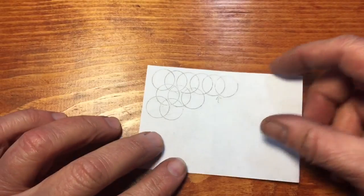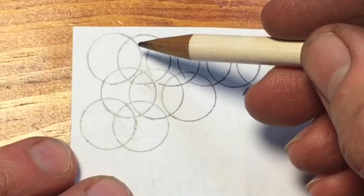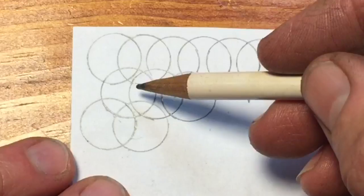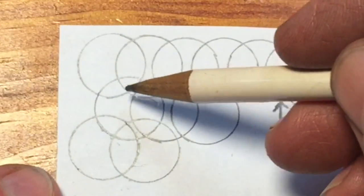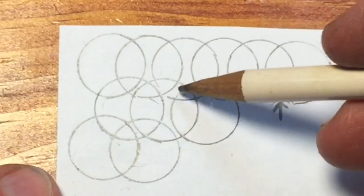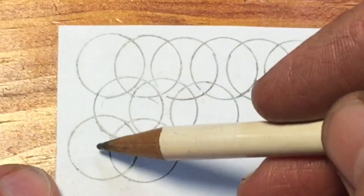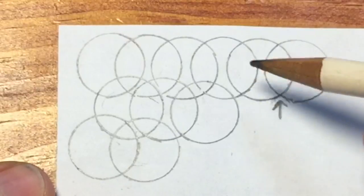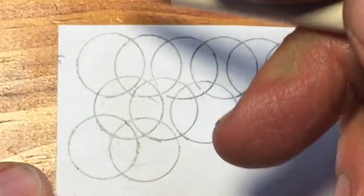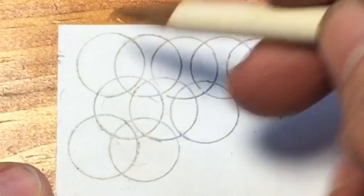Okay, let's talk about patterns. Look at that! First pattern: when you're going across, you want to get that first line nice and straight across. When you make your first swirl, your second swirl is going to overlap the first one, your third one overlaps that, your fourth overlaps that, and so on. When you go down to the second row, you're not going to start underneath the first one — you're going to go between the two. There's a little point formed there, and you're going to hit that one and overlap those, doing the same thing going all the way across. Then on the next row, you go back and start where the first row was. It's kind of overlapping, and that's what gives you the effect. When you get to the edges, you've got to be very careful, because the edge of the metal will screw up whatever you're using — whether it's Velcro, Cratex, or anything else. Be very gentle around the edges. But that's the pattern.